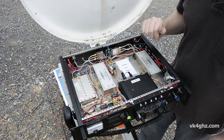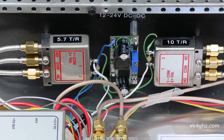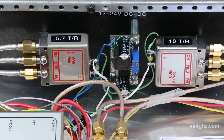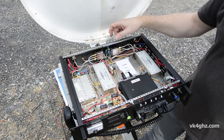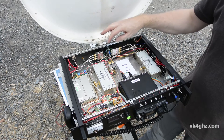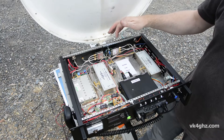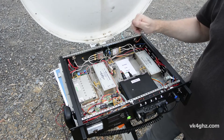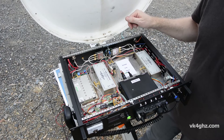These are the TR relays for each band. I've actually hooked these up in reverse, so they rest in the transmit position. I actually need to activate them to go into the receive position, which can be handy when you're running a dual band feed arrangement like this one. Because if there's any isolation problems and you're getting some leakage from one band into the other, the RF from one band is going to go up the back of the PA in the other band, and not up into a receive preamplifier, which could be problematic.